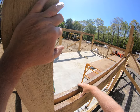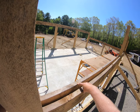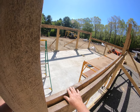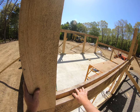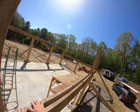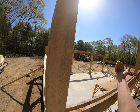you got a picture up here: it's going to be a 2x6 top plate, like over here, and then I'll have a 2x4 wall on there. I'll make sure I screw it down into this 2x12 and this 2x12. I'll screw it down on the front on an angle, and that'll give me a little lip there. And what I'm going to do is build a platform out here, maybe 3 feet wide, I don't know, all the way down the back of the barn, so that this area up here will become a nice storage space. And to hide those 2x4s, I'll just put some pine on the inside.